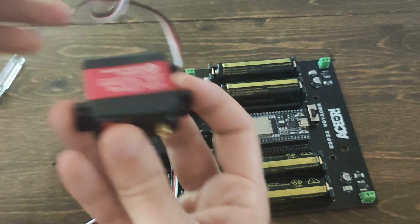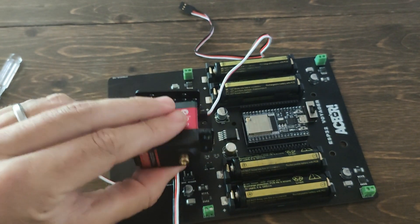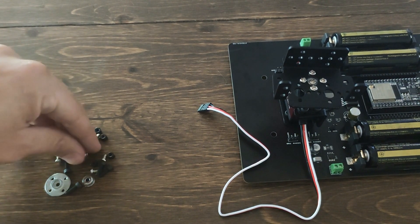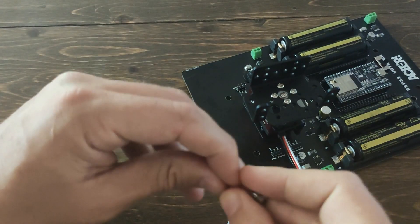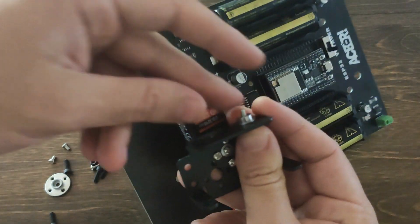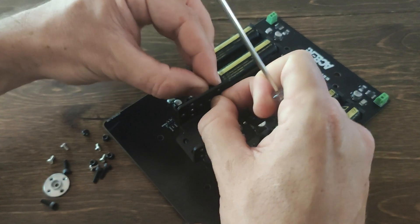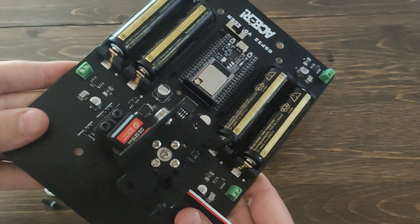Now we're going to be placing the DS3218 in this bracket just like the previous one. But before we do, we have a very important step. The shaft is going to be facing the right here, but before we attach the servo we need to attach the bearing. To attach the bearing, we're going to be using the M3 that's silver but longer than the other M3s in your kit. We stick that slightly longer M3 through here, then place the bearing with the larger part facing towards the bracket, and attach a lock nut. It's really important that you get this tight but not too tight — you want to make sure the bearing can actually freely rotate.